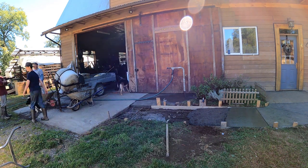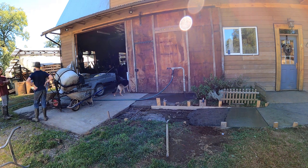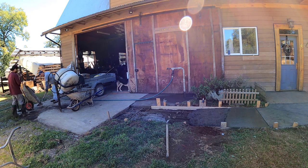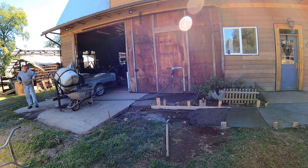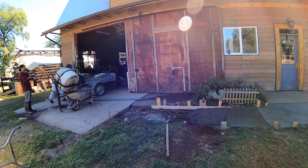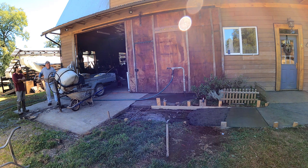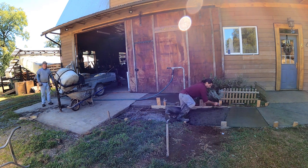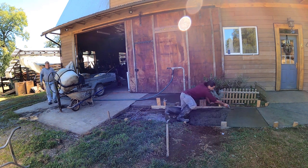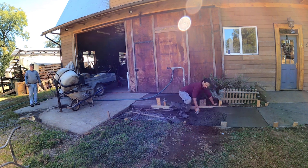The problem was how to get them out of there, and really we took a punch and knocked them out and then saved the pieces and were able to take that in and have them measured. So it's not really readily available. How do you get the bearings out? So that's why I'm hoping this video is helpful to somebody else that might have a mixer. I was really expecting it to be hung on there or bolted on there with a castle nut and a washer of some sort and a cotter pin, but it wasn't there.